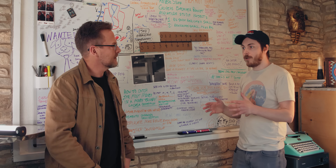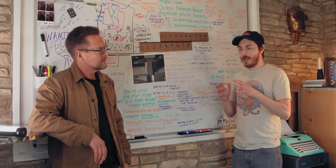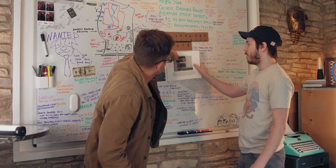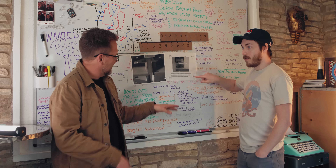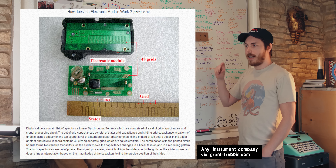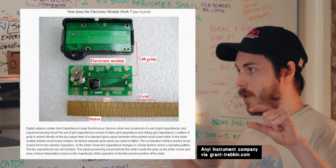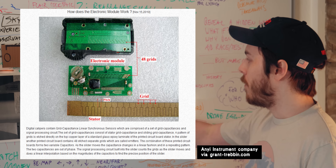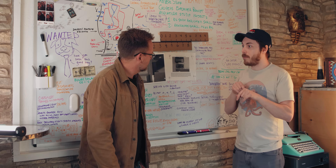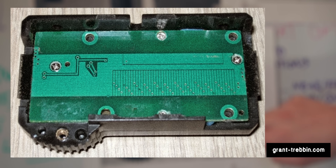Much like algebra, you can kind of squint and go, yeah, that looks about right. But the digital caliper, sometimes called the digital vernier caliper, works similarly — it has a similar design but the actual mechanism is a little bit different. So if we crack it open, you've got all these different pieces. You've got a stator — that's the piano keyboard-looking thing. It's a circuit board that is along the long edge of the ruler part of the caliper. Then we have a circuit board just behind the display, and that circuit board has a bunch of long strips with holes punched in it.